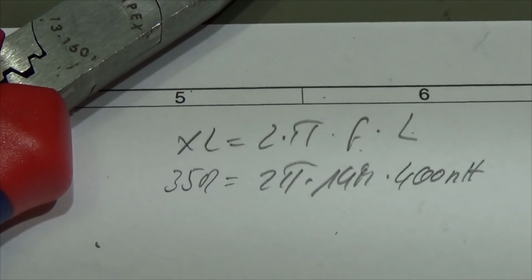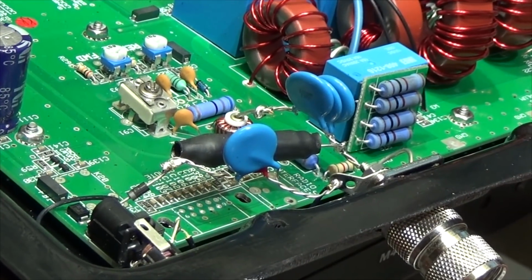Under these conditions, the RF which is getting into our bias T is now seeing the output port, which is 50 ohm, and it sees somewhat the path to our DC input. Remember, at the beginning of the video I also said that these bias T's are a kind of 3-port devices. Therefore, if we have on our DC supply path an impedance from our choke which is very similar to the impedance of our load, then both impedances get somewhat mixed up, and we will get a completely wrong SWR reading.